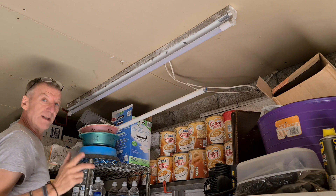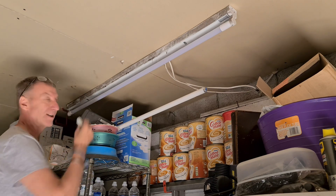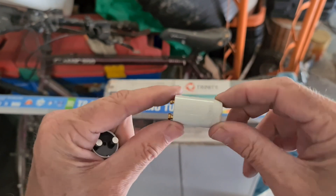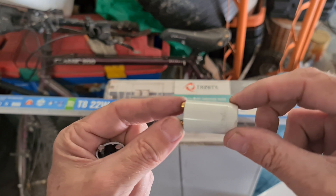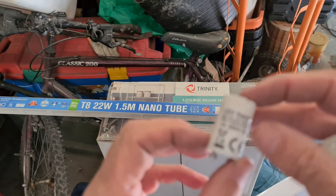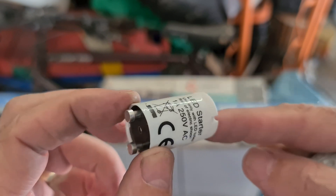Don't make the mistake I made — I had these lying around for ages and when you try lighting them with the standard fluorescent starter, it doesn't work. They come supplied separately with a one-amp starter. The standard fluorescent starter you'd take out — something like a 50-watt rated one — will categorically not start these LED tubes. You need a one-amp, 250-volt starter. That is how you get these LED strips to actually work.